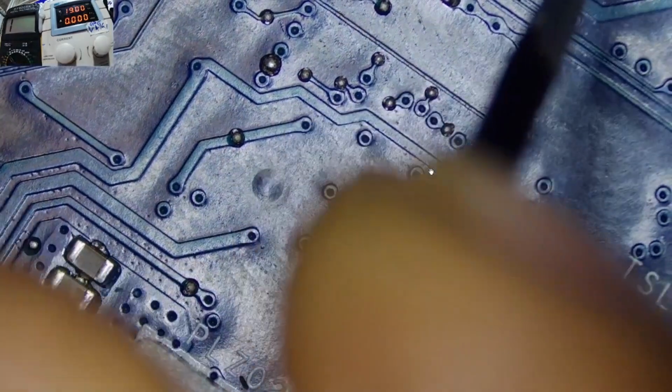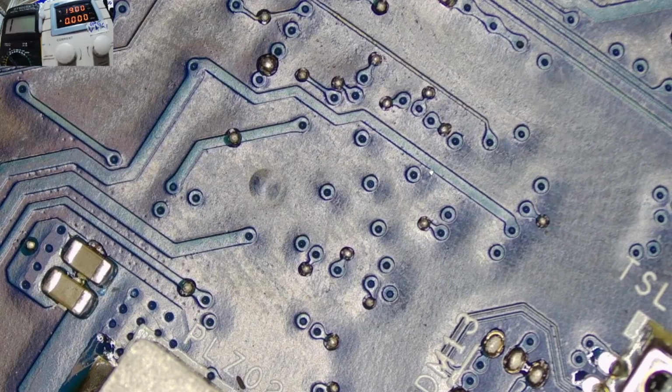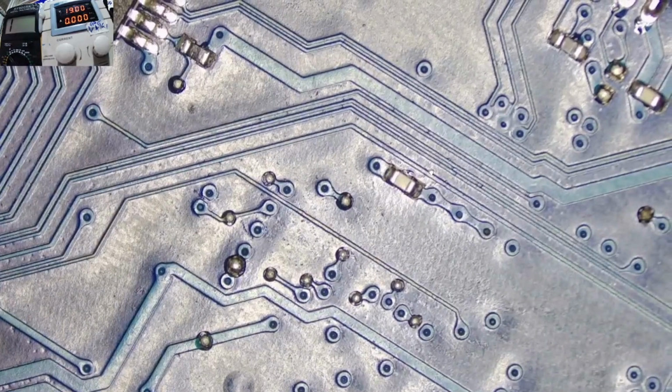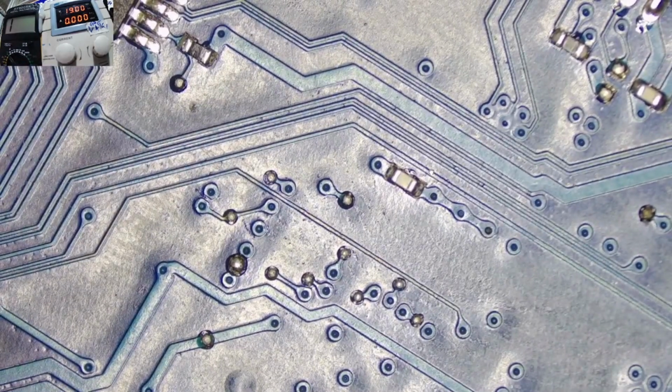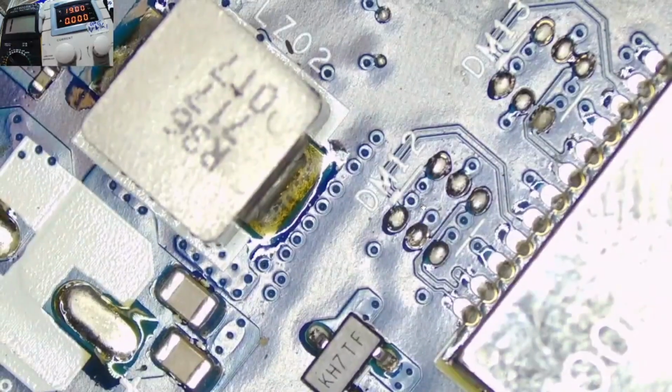Yeah, I found a voltage on the BIOS chip, and the laptop is on the 1.8 volts. We have the 19 volts. And I'm wondering what is making this laptop not work. What to go on. Yeah, it's very confusing when you're having voltage. Sometimes you're having the voltage also on those first and the second MOSFET. You remember, I was having a voltage, and then sometimes I'm not having the voltage.